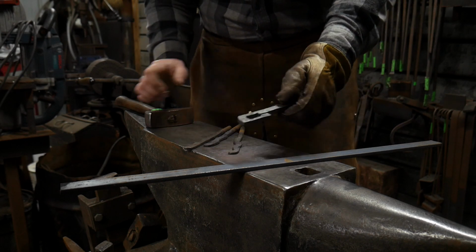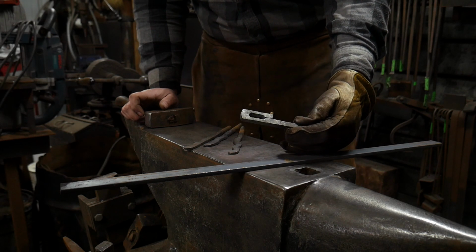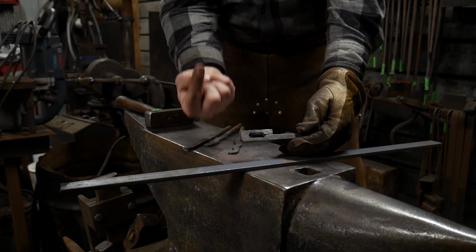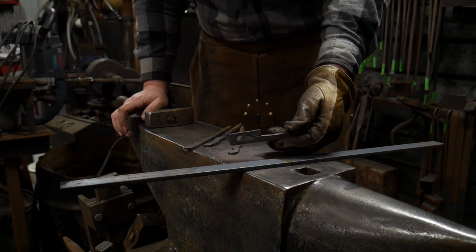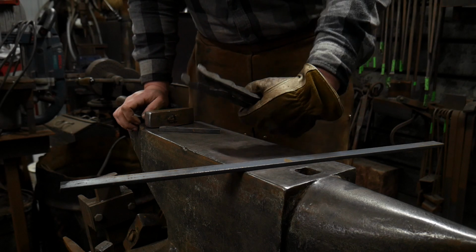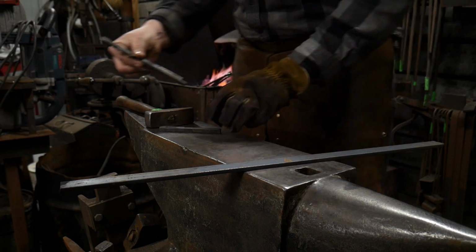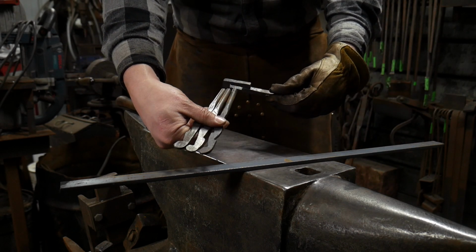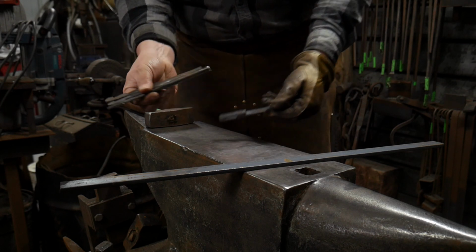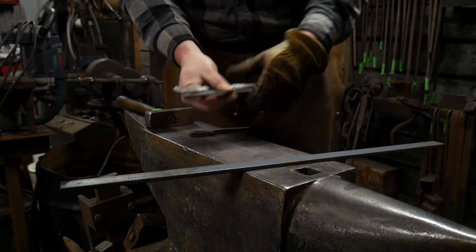At the end. Now, if y'all haven't seen the video yet, you might notice this one from a video that we did titled Double Shoulders. I'll put the link to that video right up there, and I'll also put one in the description so you guys can find it. But basically, I've taken some different forged elements, some different scrolls and things that we've made in a previous video, and I've put them all through this little collar that I made, and that's wedged them all in to hold them together so I can get a forge weld on all the individual ends.